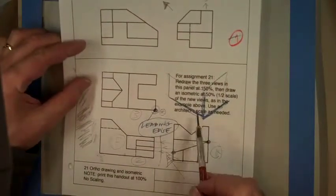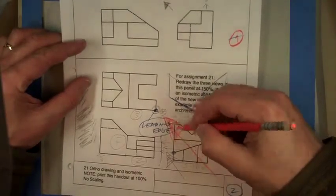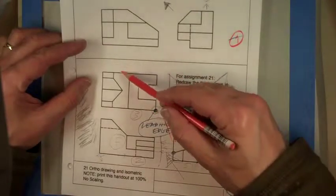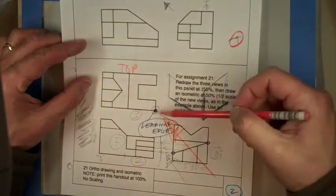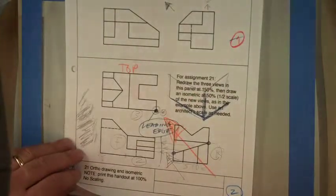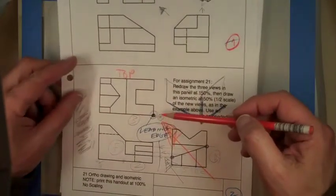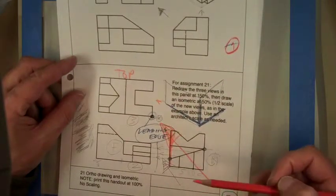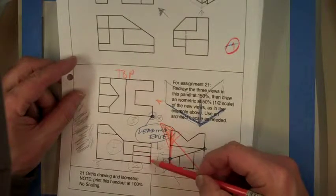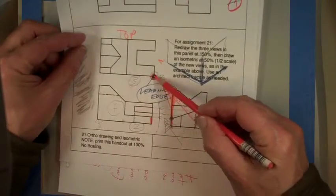The position of the object is going to be looking at from this angle. This is the plan view — the top — so we're going to be looking at this edge being the first thing in front, called the leading edge. When you look at the object, this view represents this edge here, which is these two lines.